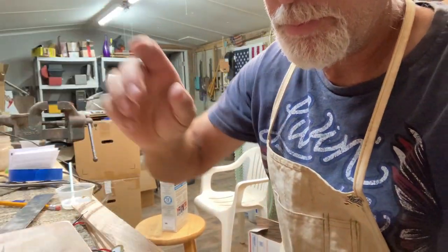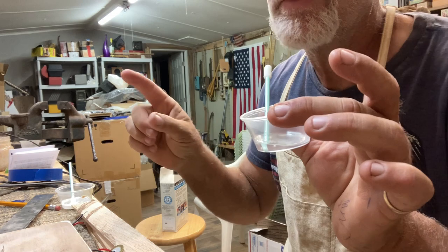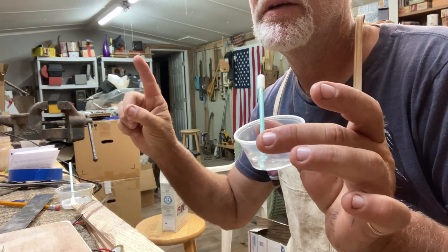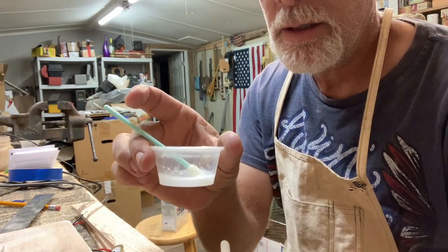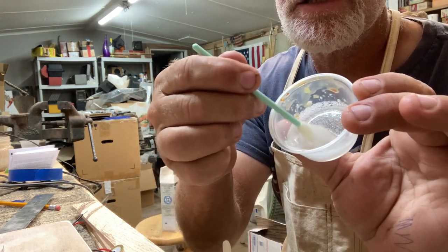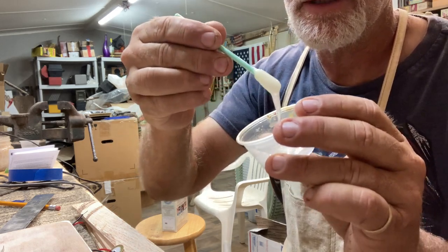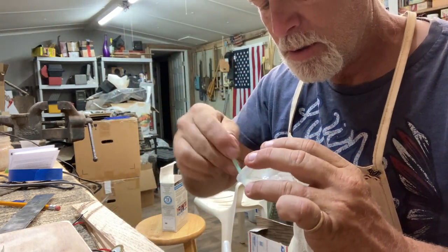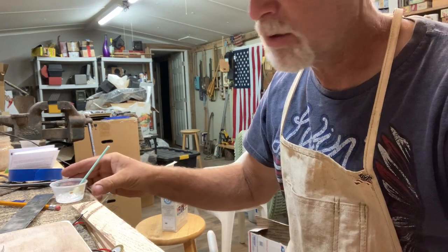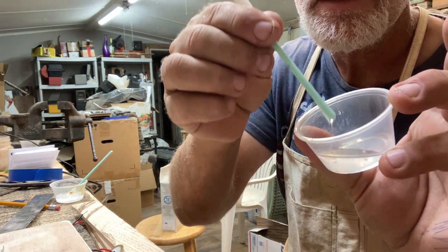Okay, so I was gonna leave you with this little bit of information. What to do with the remaining epoxy? Well, I don't know if you can see it, but way up there on the wall, on the shelf, I set that neck so it could dry. But I have two of these. I have the bubble-icious effervescence, and I was just whipping this thing up like whipped cream. Just making this thing really bubbly. It's like, oh my gosh, this is like white. And then this here is still crystal clear. So if you take your time and just kind of stir it slowly, it stays bubble free.